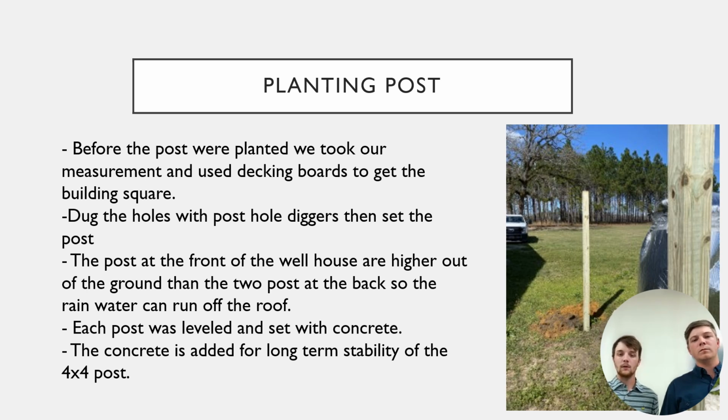And after speaking with Mr. Grant, we talked about it and we figured we'd want about a foot at the minimum at the lowest point of the roof above the top of the tank, just in case it ever had to be taken out of there or anything like that. It would be adequate room there to do that.